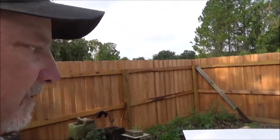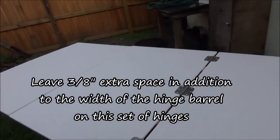It is hot out here this morning. Pay attention to this step because it's important. You'll see the importance of marking that first hinge set at the bottom as 'front right' — the front right panel when looking at it assembled. We moved those two panels, flipped them over, and moved them to this end. I marked it 'RR' for right rear of the right panel. We want that to be up when we lay out the second set of hinges, so this will fold like an accordion.